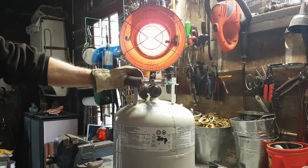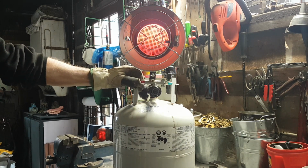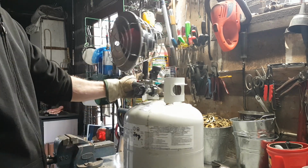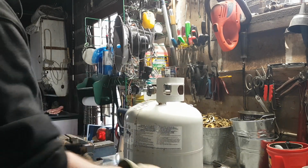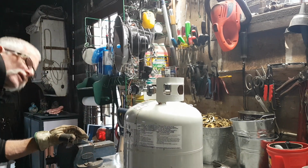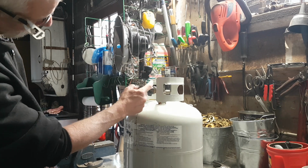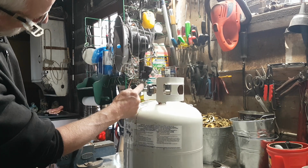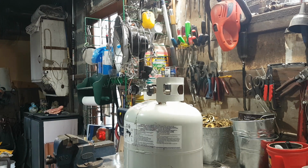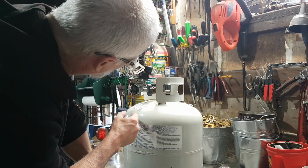But you can really feel a lot of heat coming off of that, and that'd be perfect for in here. But it doesn't want to stay lit. So something's wrong with that switch in here. I don't know what. I don't see any button on it. It's an automatic switch, and I'm thinking that switch is in the off position. The pilot runs through the switch, up through there, and then back to here again. So I'm gonna put a little more light on this subject. I'm thinking the switch is not doing its job.